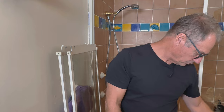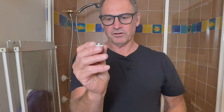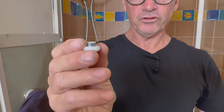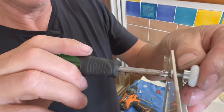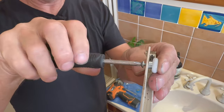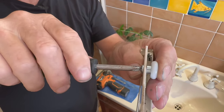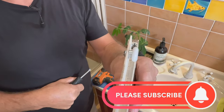Slightly different roller — when they're manufactured, they used to put the shorter shaft roller in, so I'm going to put this in first and just see how it sits. If it doesn't sit correctly, I'll put the larger roller in. It just depends on the waggle or the dangle of the door. I've done this a thousand times. Square so you don't strip it. Super simple — firm, then back it off so it doesn't move up and down.